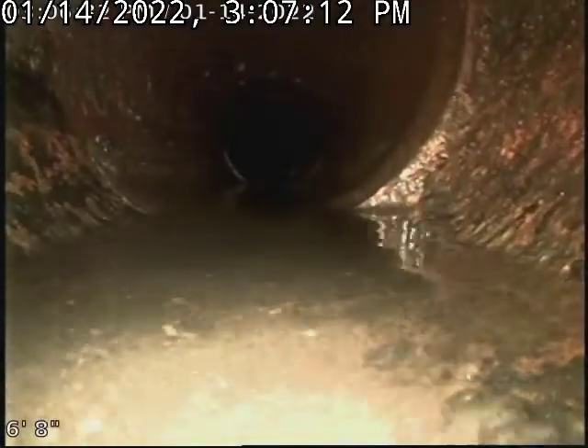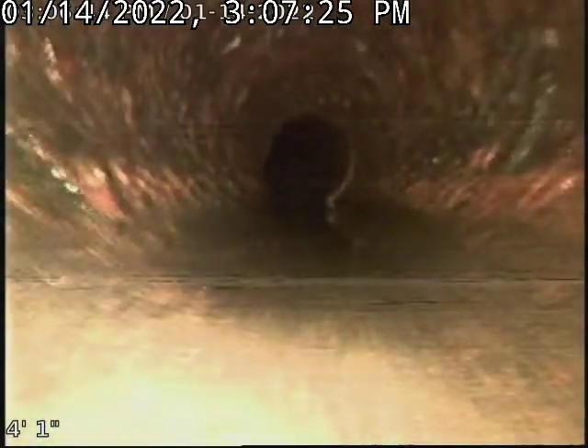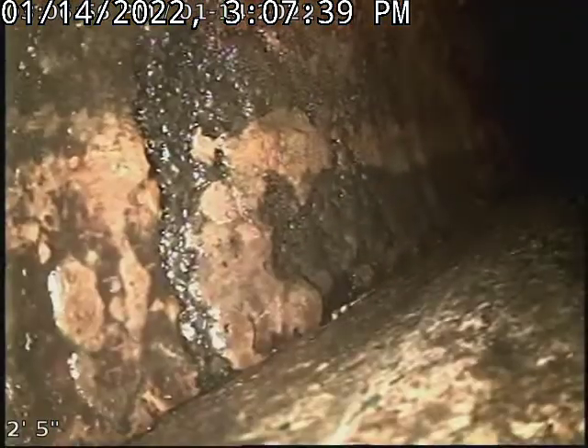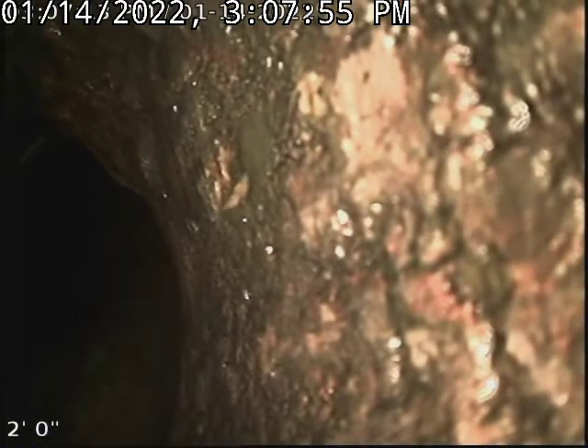The camera makes it look worse than what it is. I'm going to say that it's six inch cast iron because it sure looks like it to me. Six feet — well, four feet — because it sticks out of the house at least four feet. I figure a foot inside. If you can grab that, that would be nice, because that is the curious-looking hump of the pipe. Even the pipe itself looks six inch. We know that it's four inch inside the house, but your sewer is not boring — it's going to be six inch. Definitely six inch.